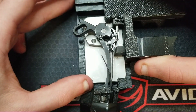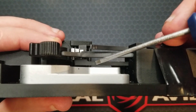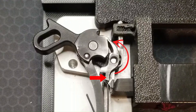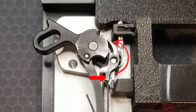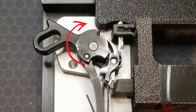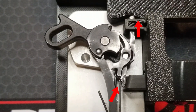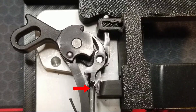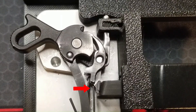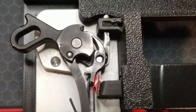In the cocked position, the hammer strut has compressed the main spring. The left sear spring tang has pivoted the sear tip into engagement with the hammer hooks and is holding it in the cocked position against the force from that compressed main spring that is trying to pivot the hammer forward. The disconnector is being pushed up by the center tang of the sear spring into the disconnector pocket in the bottom of the slide, which is over the disconnector tip when the slide is in battery. It is also pushing the disconnector forward into the back of the trigger bow. You can see at this point the disconnector is not contacting the sear legs.